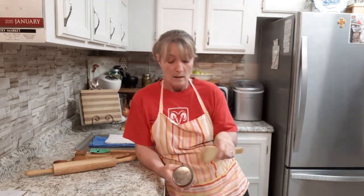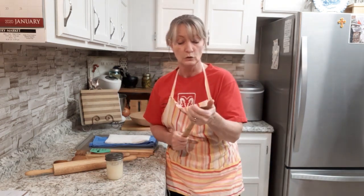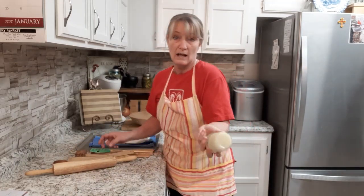So I'm off olive oil. And coconut oil — I've used that. It's less likely to go rancid than olive oil; olive oil is actually a lot more likely to go rancid than coconut oil. But what I've found is that walnut oil is one of the best to use. It penetrates better — it actually penetrates into the wood really well — and it is edible, and it just does better, I think.